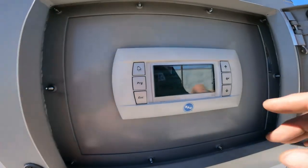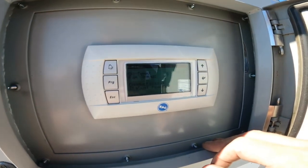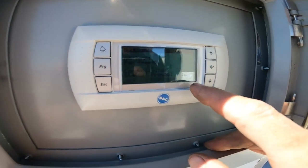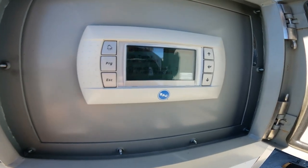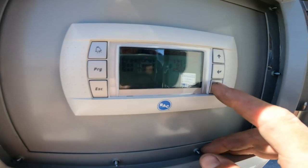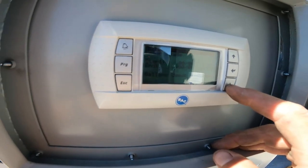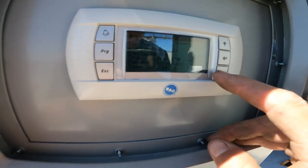Okay. This one's out of air temp, 85 degrees, so it's above 80, guys. It has a conductivity sensor in there, so it measures the conductivity for drain and stuff, but it's pretty good here. So pressure's 191, R507, 80 degrees, there it is.